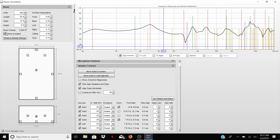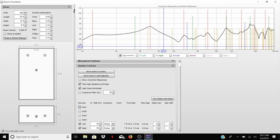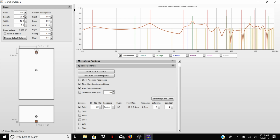Now here I'm showing what happens when you seal the room versus not. You can see that by sealing the room, the lowest frequencies are enhanced a bit. Most rooms are not truly sealed, but if you have a room, especially one that's like a soundproof room that's been built with very tight construction and very solid doors, it might perform more like a sealed room, especially if it's in a basement with those really, really solid, rigid concrete walls, versus upstairs or a main floor where the wall construction is such that it wouldn't probably act like a true sealed room.